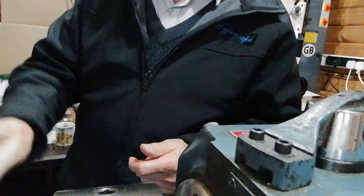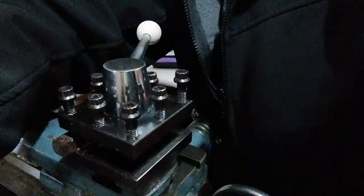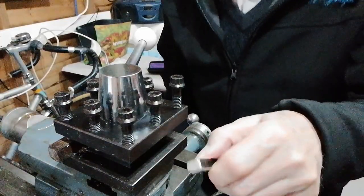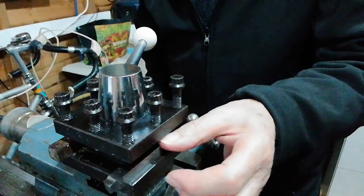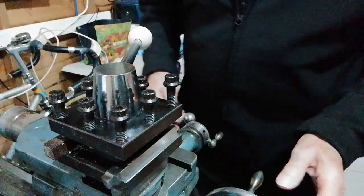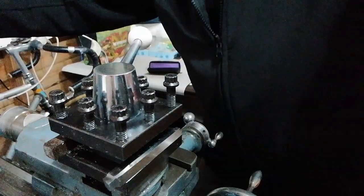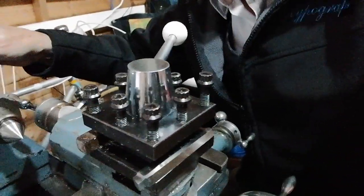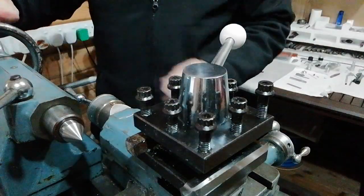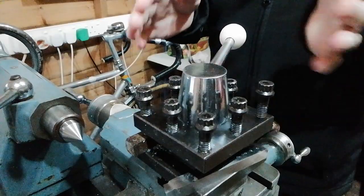In the meantime, back to the tool. This is the tool post in question. This is a standard four-way tool post and we're going to set the tool in this particular position here, for cutting in this direction towards the chuck. The best thing to do is to put the centre in the tail stock and bring the tail stock into play. I've already put a dead centre in it, and we're going to line the cutter point up with the centre on the tail stock, and that'll give us an accurate position to start with.